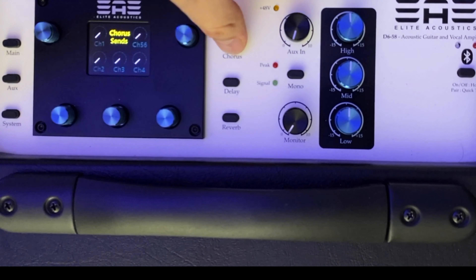Now the most important thing - if we click on channel 1 we get a low cut, a high, a mid frequency, a mid control and a low control. Very powerful. The low cut is something I wish all amps had - I can set that to say 100 and it will cut everything below that to get rid of rumbling. Most people use around 80, I like 100. On something like a K&K you can bring this up to 130-140 and get rid of all that potential feedback. You can set the mid frequency all the way from 0.1k up to 6k and set the high here. It's great that you have this plus physical controls - if you're just playing guitar you could leave this flat and use your physical controls, or use a combination of the two.